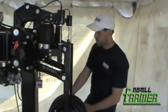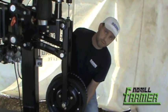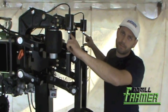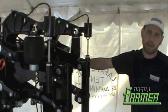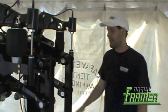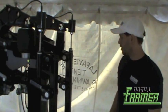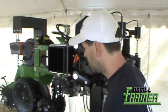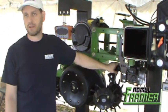What happens is we see a change in difference in depth between these two rolling objects. We have a difference in these linear position sensors, and we feed that signal into a PLC back here — a small, very rugged computer that can take the elements and fluids from the implement. We do a little math on it and directly translate that into what is going to be required for the downforce actuator and for the row cleaner.